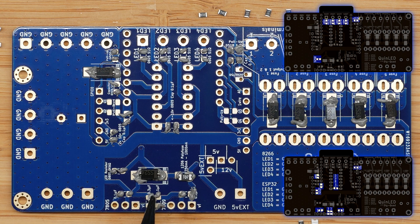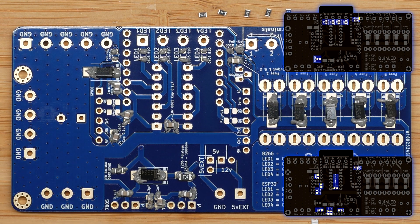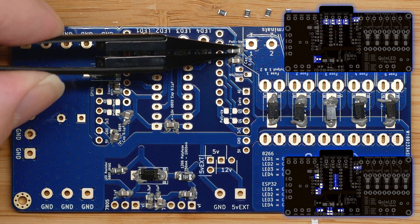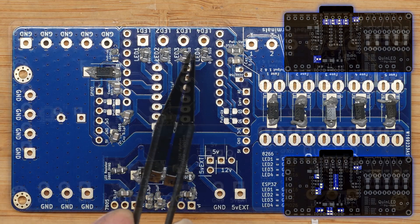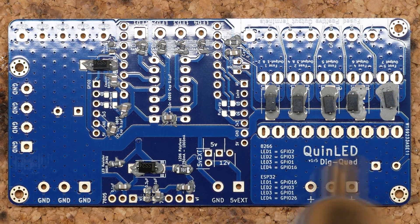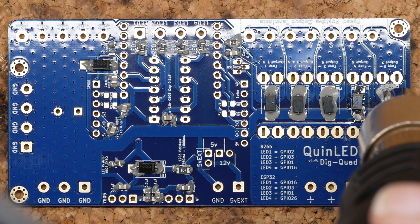I started doing the diodes, and now I'm doing the resistors and capacitors mixed through each other — but as I said, there are images to show you where it all goes. Once all components are on their pads, let's take the hot air gun and basically melt the paste into solder.